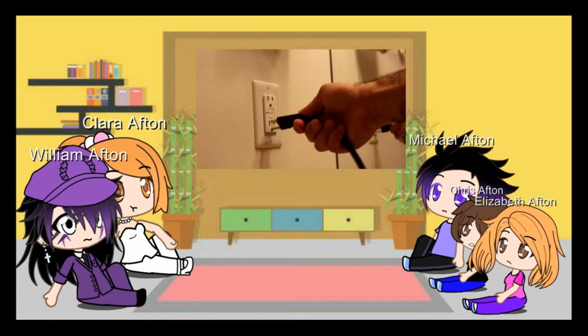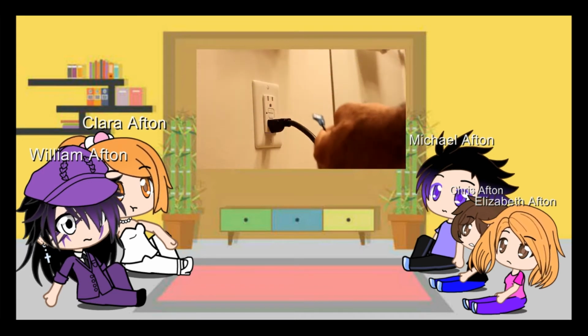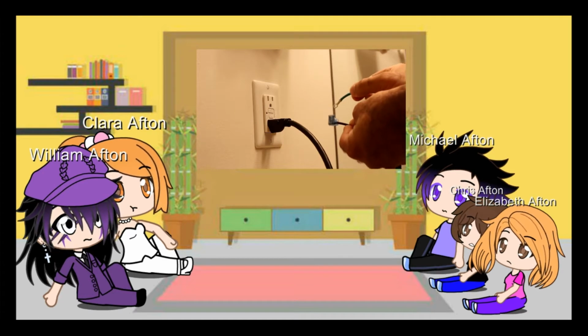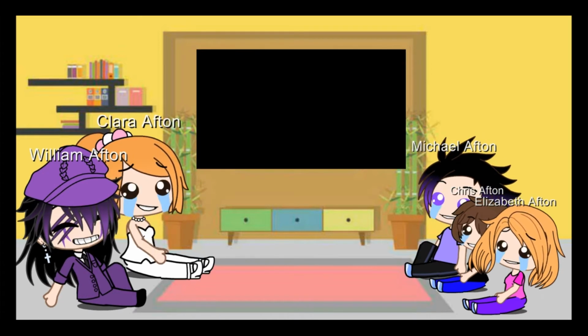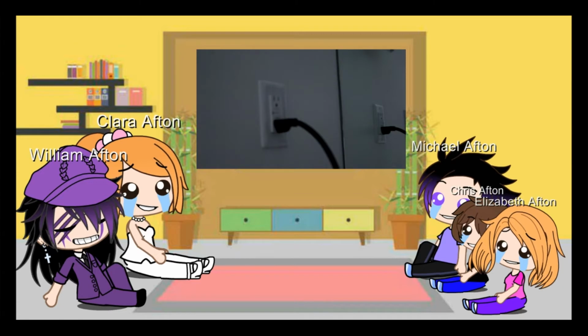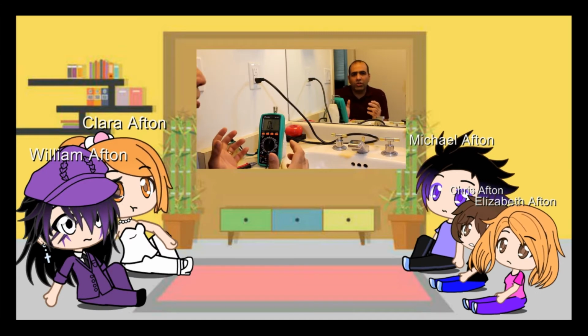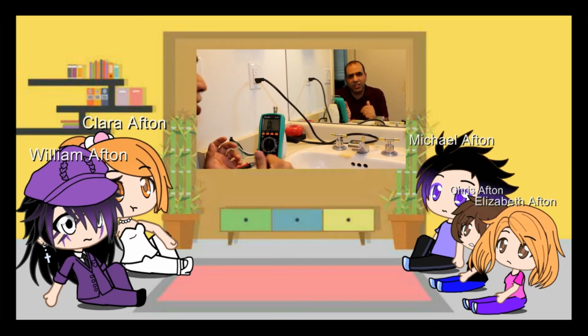Now if I plug in my wire and short the live, which is the black wire, to the earth, which is the green, the breaker should pop. That wasn't the outlet breaker. The whole washroom breaker popped. Okay then, if it's a dead short, the room breaker opens quicker than the GFCI.